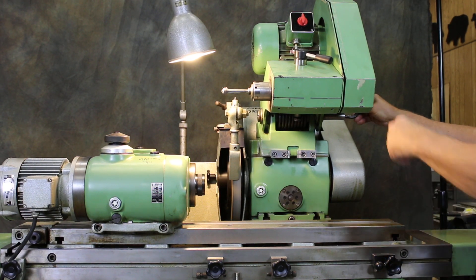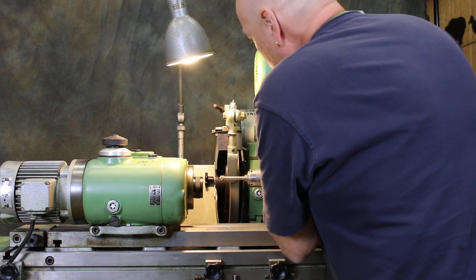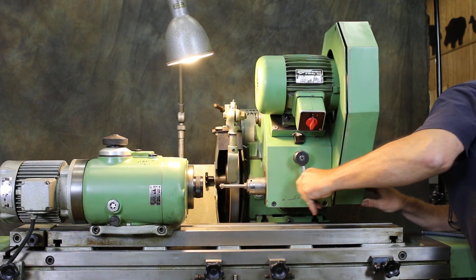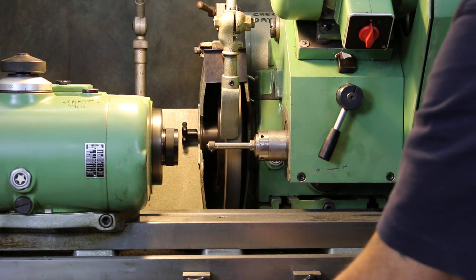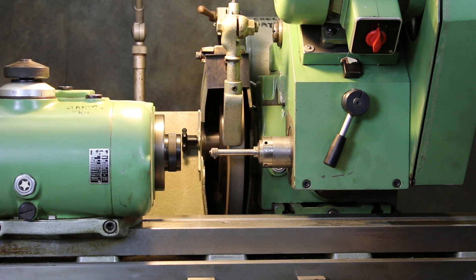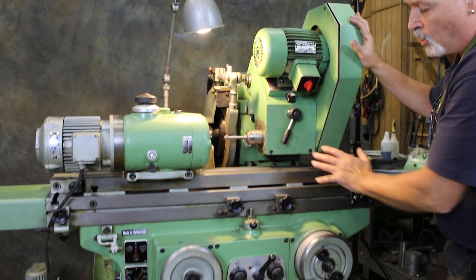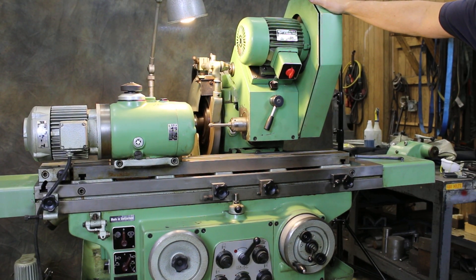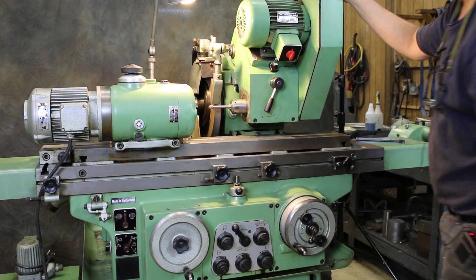There's a little lock on the side of this that puts more or less tension on it, but there is a big spring so it can't really drop on you. And I know that it's going to clear everything. This gets folded down, and there's a lock in the back that it has to be in. Normally you bring it forward all the way. There's a mechanical device in the rear of the machine called the retraction limitation device. You have to screw that part in and tighten it so that at the end of your internal grinding cycle, as you're going back and forth, you can still have an in-feed. But at the end of the cycle, the wheel head could go back. There is a safety device — common on all these grinders — so that when you're internal grinding, you will not have this rapid in and out, as it's a potential for an obvious accident.